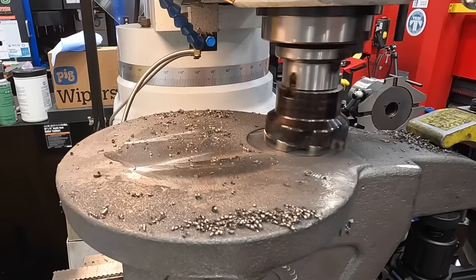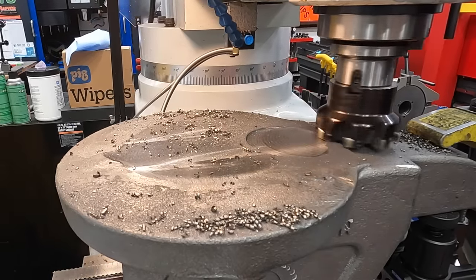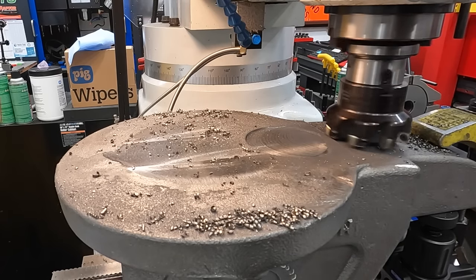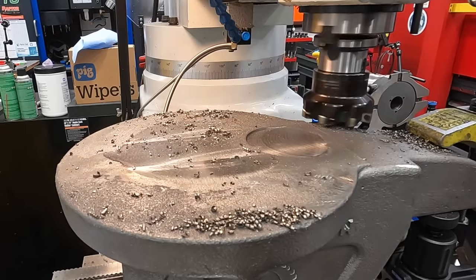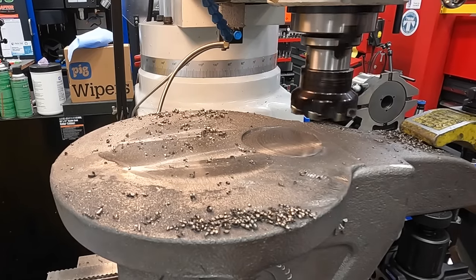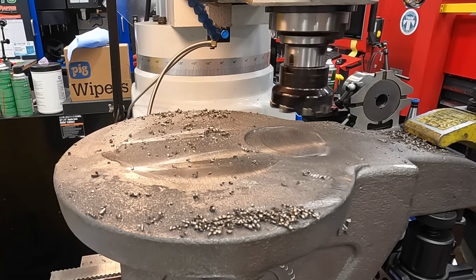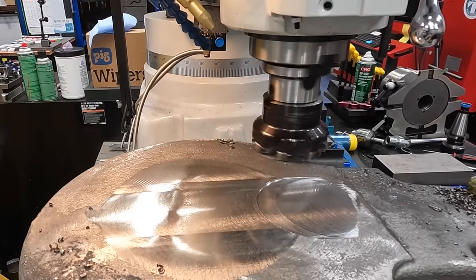Tell you what we're going to do. Instead of making that 3-inch wide cut, let's go ahead and move it on out and we'll make our passes, because those were going to be about 2.5 inch per pass. So let's see if we can handle that a little bit better. Just a lot of cut for these types of milling machines on a big wide cutter like that. I'm gonna go ahead and start on the outside, just offsetting it 4 inches total from the center. And let's see if we can start making our passes. Speed that back up on our feed.